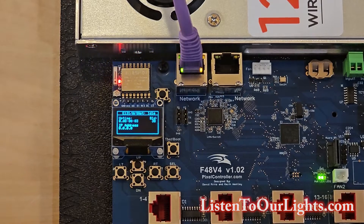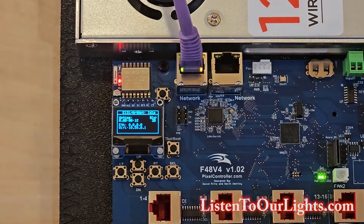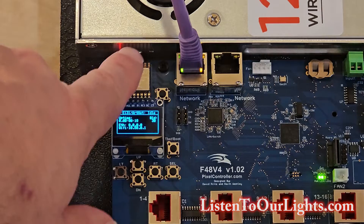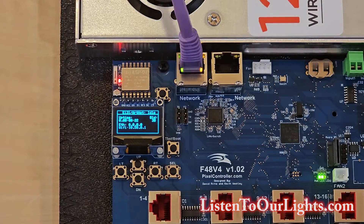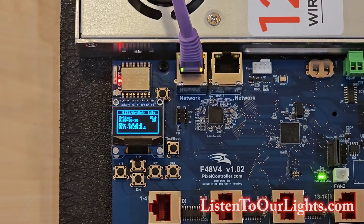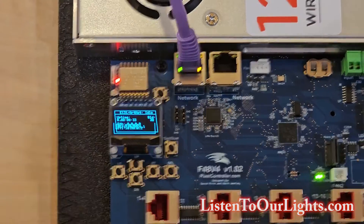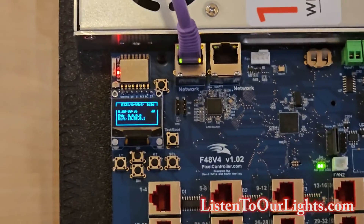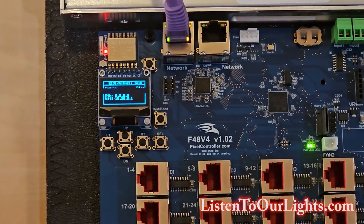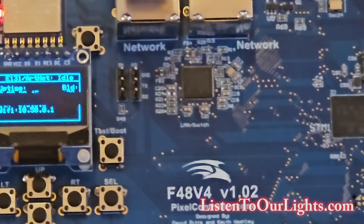Falcon Christmas! Now you'll notice that these boards boot really fast — I mean, it's up right away. Up here you can see the green and the yellow light that shows we have connectivity back to the Ethernet switch, which is really important. We have this green light down here, which means we have power. And then we have the OLED display — the fancy name for little screen. So we're going to zoom in on the OLED display.